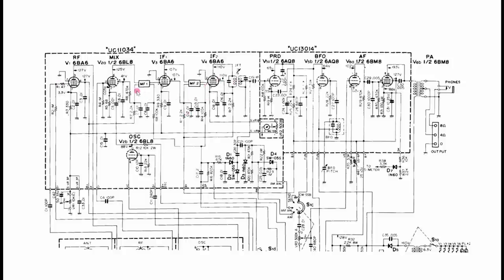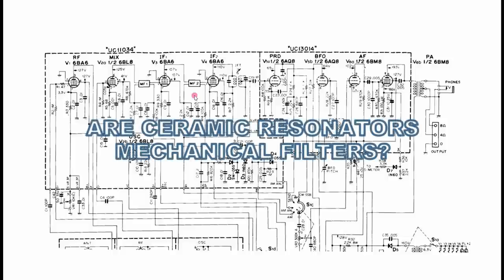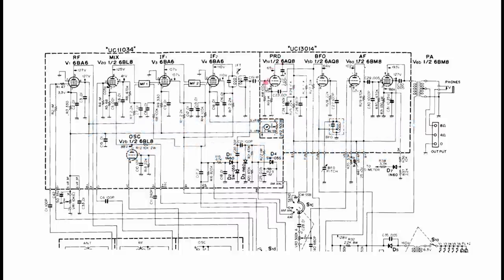Notice that these two filters are called MF1 and MF2. We'll go over that a little bit later. Then we have a true product detector — product detector shows that this receiver is a late design, probably more like late 50s, early 60s design, where single sideband was becoming more and more important. Finally, the audio amplifier stage with several diodes associated with the AM detector, as well as the automatic volume control circuit and an automatic noise limiter diode. The S-meter is simply measuring the cathode current of the second IF stage — a clever way to get an S-meter.